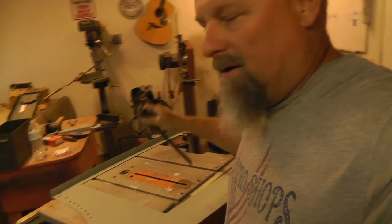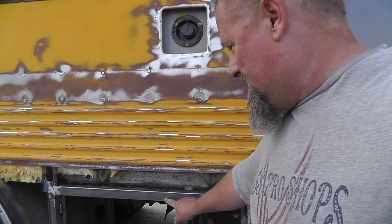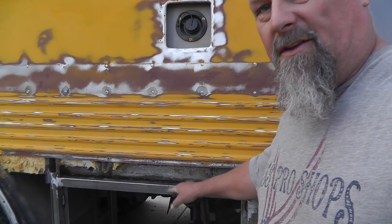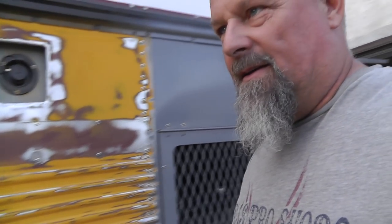This piece of steel I had already cut and fabbed for the old battery box — I had already cut the hole in for the battery box and did all the framing over there, but I didn't check it and discovered that this piece right here was three-quarters of an inch into the existing cut. So my choices were $52 for a new four-by-ten piece of 20-gauge steel, or cut this piece out and raise it up. That's what I did — I cut that piece out and raised it up and now it fits.